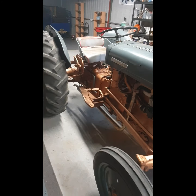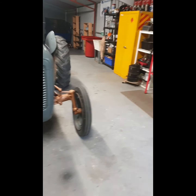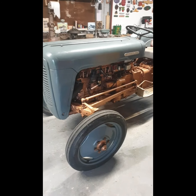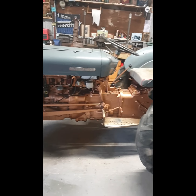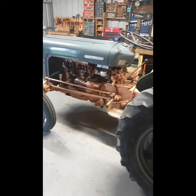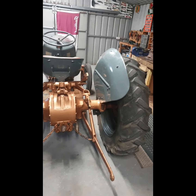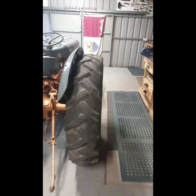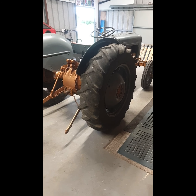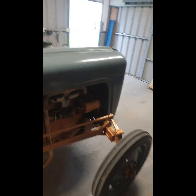There was obviously the question of whether, after stripping the engine down, I should take it out and get a full rebuild done like I've done on my other two Fergusons, but I'd sooner work with what I have and can always do that down the road if needed. I was more concerned with getting oil back in, getting it together, and seeing if the water was still getting into the oil - and it doesn't seem to be. Three months of work, not too many parts - more a bit of tuning, cleaning, removing and refitting to improve and get to know this engine and a model that's a little rarer than your usual Ferguson 35. Thanks to everyone who has liked, commented or subscribed - it does help inspire me to keep uploading and documenting the journey of getting this old machine back to a functional state.